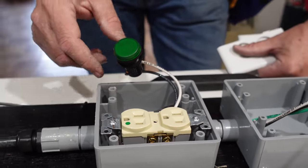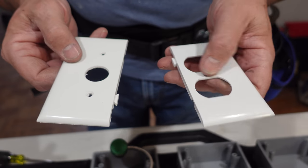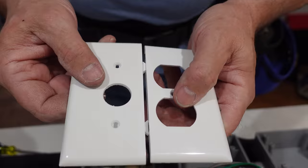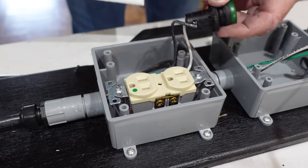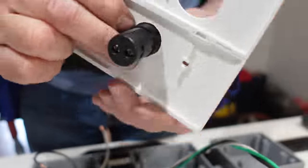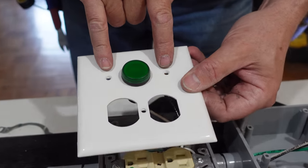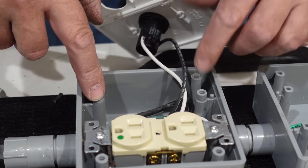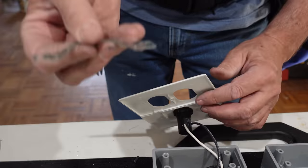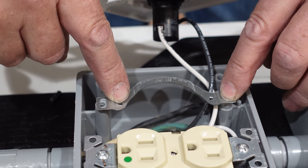You may be asking how we're going to put a cover plate on there with a duplex receptacle on one side and a round hole on the other. We've got these build-your-own cover plates — a duplex receptacle opening on the left and a blank on the right with a hole we drilled for the light. These little tabs lock together and you can also get middle pieces to make it as long as you want. To adapt between the device mount plate and the box, the manufacturer provides a yoke that mounts to the box, and the plate mounts to the yoke's tapped holes. The first box is all done.